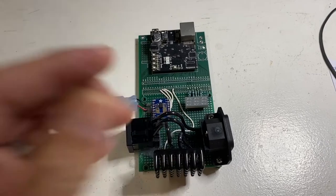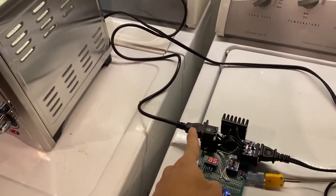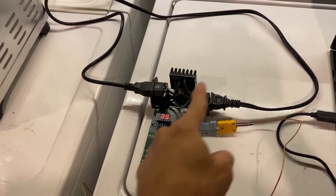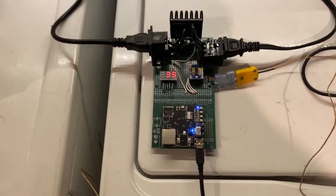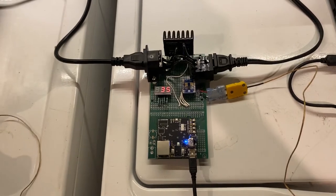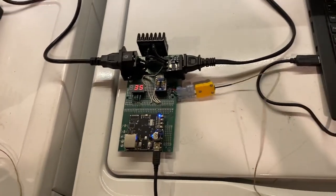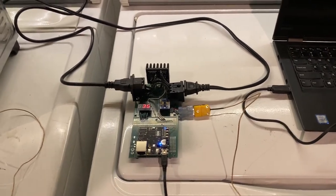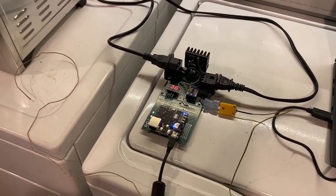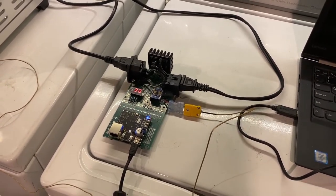So let's hook it up to the real oven and see how it works. Everything is plugged in. The main power is coming from the power cord over there, controlled by this microcontroller, and the oven is plugged in on the other side. I have the thermocouple plugged in as well — it reads 35 degrees Celsius. Pretty hot, to be honest, in the summer right now. I can also get a log of my temperature profile, so it will be useful to verify that all my algorithms work.